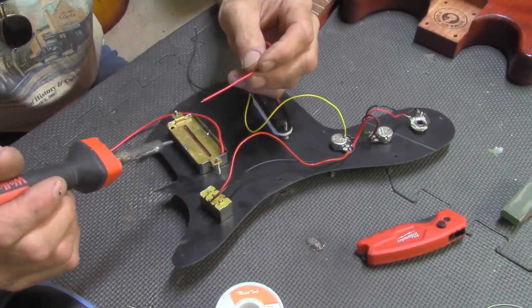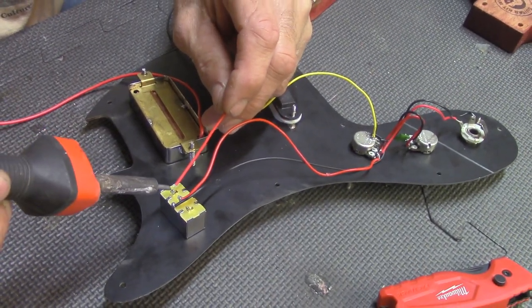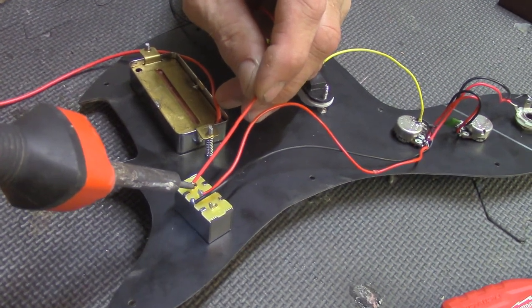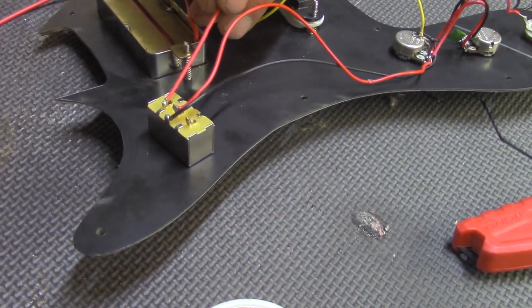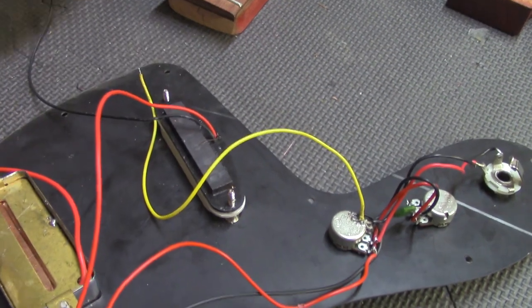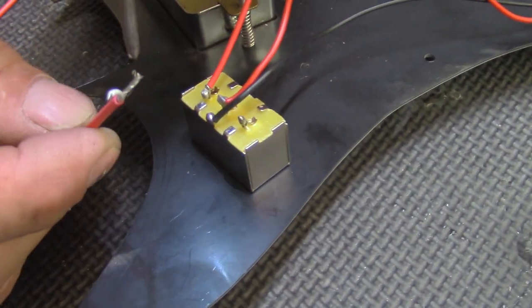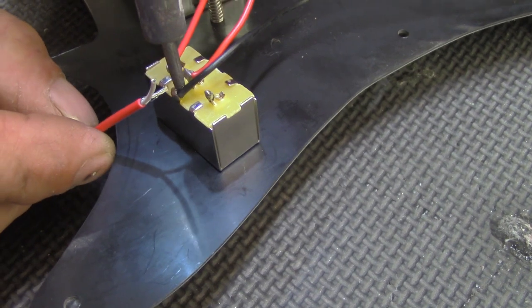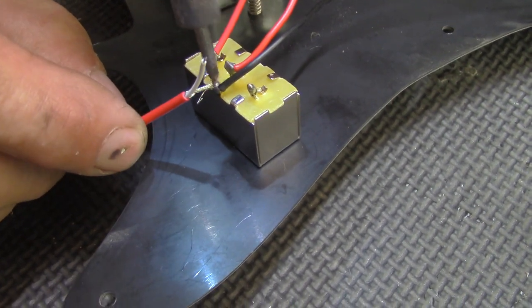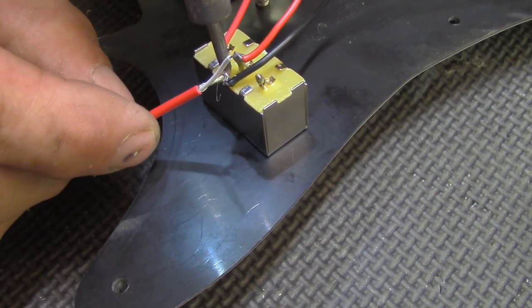Well, I watched a couple videos on YouTube. You all tell me if I'm doing it wrong, right? We brought it inside to wire it up. So what does that wire go to? Goes to the bottom pickup, goes to the bridge pickup. Yeah, that's the hot. That was the hot. And this one goes to the ground — the bare. I see it. You said there's a hole in there? There should be. I found it.